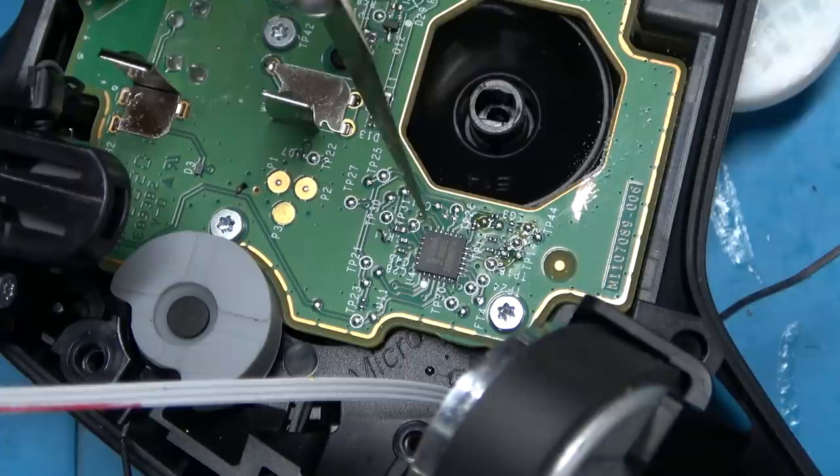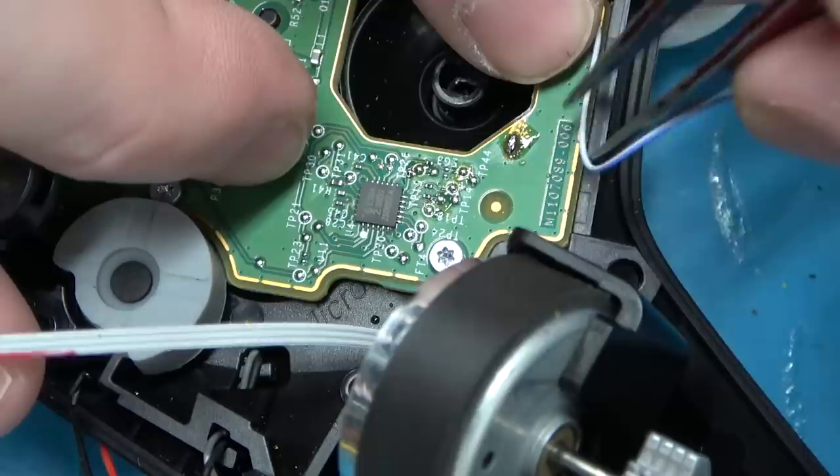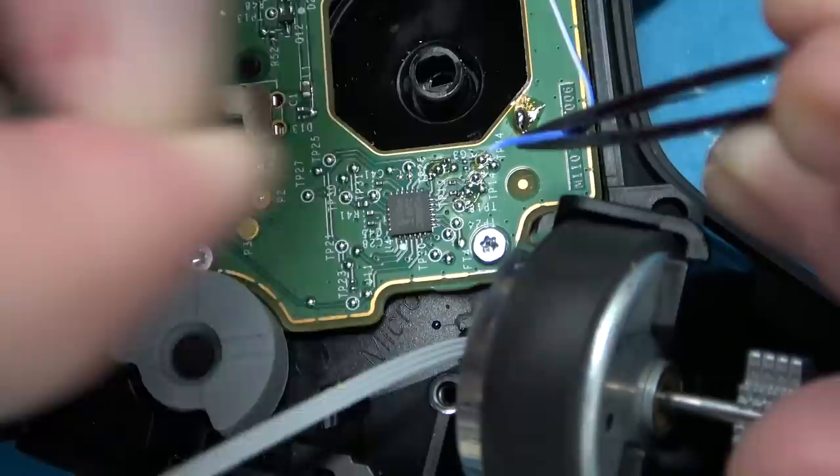What is this little chip right there? That is an NXP I2C Serial I/O Expander. That is a device where you can have up to 16 I/O inputs. The device will store them in its own internal memory, and then a microcontroller can poll that device using the I2C format, which only takes two lines. The device will send back two bytes which is the status of its 16 I/O pins.